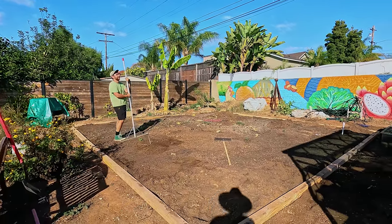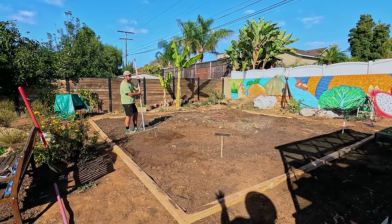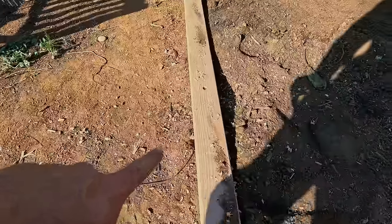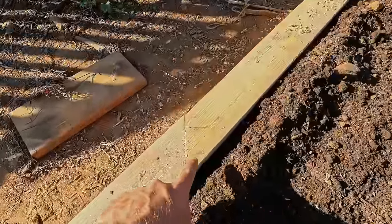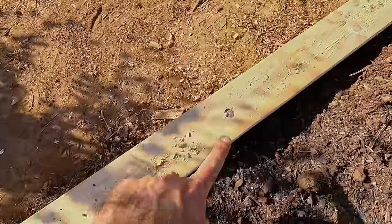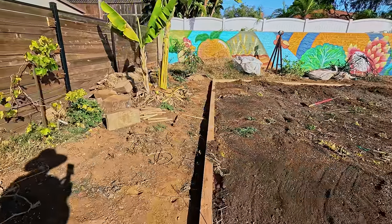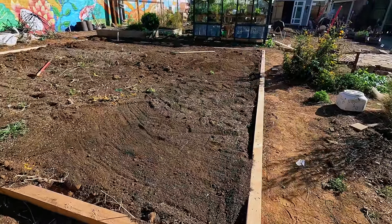We got it all in. We're talking about a 24 by 24 foot raised bed essentially, and this isn't bad. The corners have two lag screws going into the other timber, and then every single one of the end boards has a piece of rebar hammered into it. In the middle sections you have the 45-degree joints, and each one of those gets two rebar. So every single wall basically has four rebars in it to hold it all together. This whole dimension is all squared up — honestly, it's actually quite straight, and I'm very pleased with that.